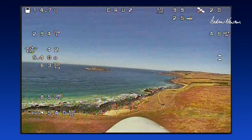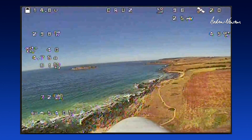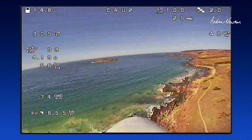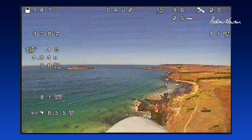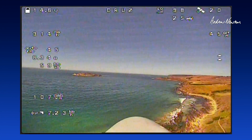They're pretty good actually. A few lines there, to be expected. Using VBAT I could add more filtering myself. There is a capacitor on the board but obviously it's not taking all the interference out. But it's pretty good, not too worried about that.